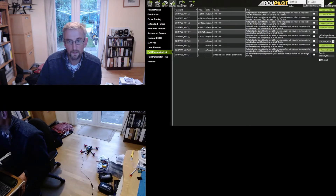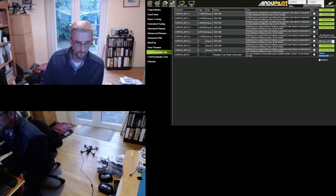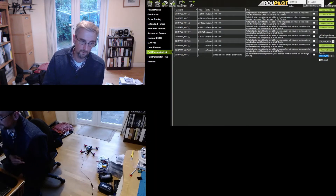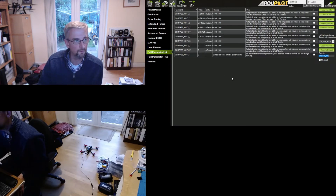Overall I'm very happy with that test. I'll reboot the autopilot, check that the EKF and values look correct with the offsets set. I've got two IMUs on this flight controller: the MPU-6000 which is not noisy, and the ICM-20602 that is noisy. I've also got two compasses, one of which is more noisy than the other. I basically want the non-noisy IMU to go with the non-noisy compass as my primary.